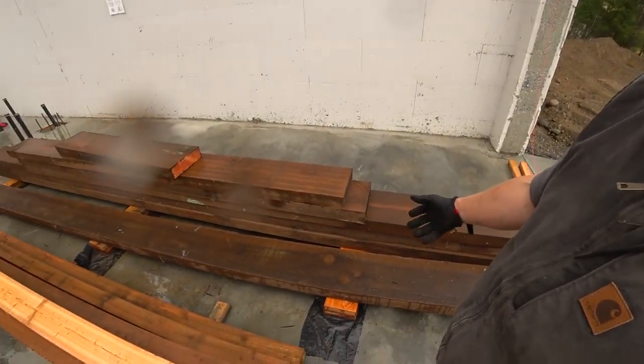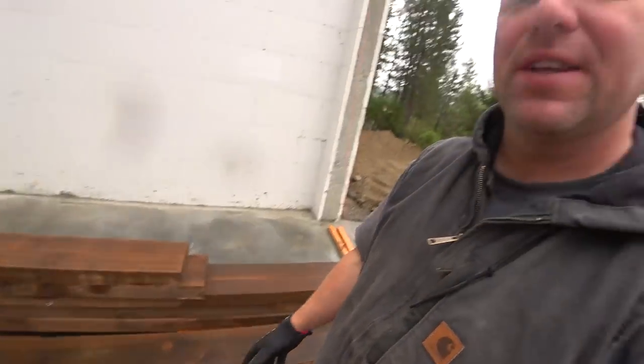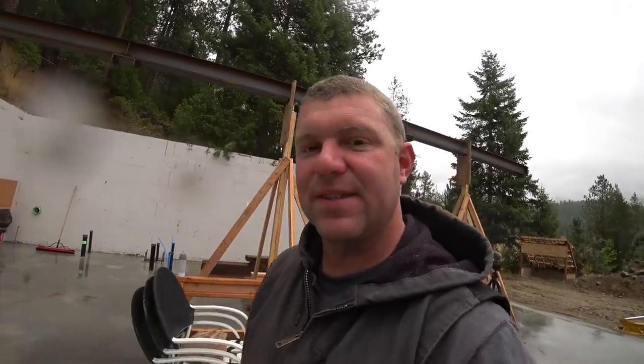Right at the end of our video last night in the dark, we actually put a second sill plate on just to kind of test the overall condition of our top of wall. Everything has tolerances — our wall was really, really close, so close we were kind of freaked out and thought we'd triple check it. But these sill plates we're using, which are single-sawn pressure-treated ground-contact four-by-twelves, they're also not perfect. There's tolerance there. When we set these plates up on the butt joint, there's a very small gap. So I think we're going to proceed on with getting the sill plates installed and kind of see how the overall looks, and then make a decision about how to get the joints in the sill plates to look correct.